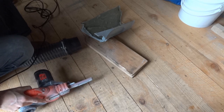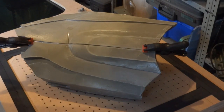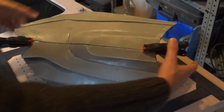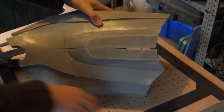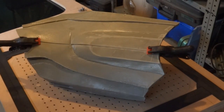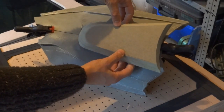That seems excellent — normally dust just goes everywhere. Here's one of the thighs which I've started doing some cleanup on. Probably the worst parts are the side panels. As I mentioned in one of the previous videos, I'm actually going to make replacements for those which fit on over the top. Those are going to be used to latch the two halves of the thigh together so that it holds them onto the strapping system underneath. The way I'm going to do that is with a vacuum form. This is my vacuum form table which I made, and I've made a wooden vacuum form mould which is going to fit over that.